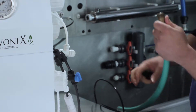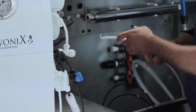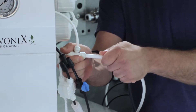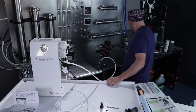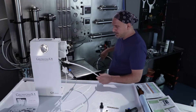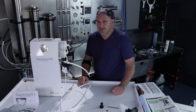We're going to hook it up to tubing — grab our 3/8" feed water tubing and seat it into the reducing T all the way, past the O-rings, fully seated. We're hooking it up to a 3/4 inch stainless valve on about 6 feet of tubing. And it's that simple — we're all plumbed in on this GX400.